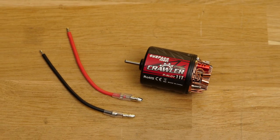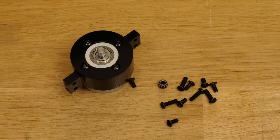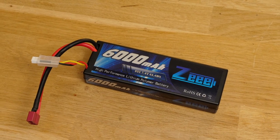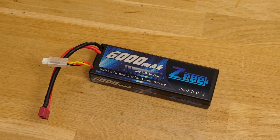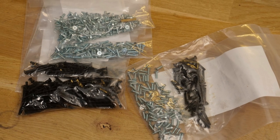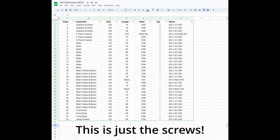In terms of part selection and sourcing, I'm building the Pro Drive version, which is what I'd recommend and was recommended to me by Sam Prentice. This exchanges the Pololu motors and PCB for some high performance motors with a gearbox and ESCs, or electronic speed controllers. I've also opted for a different battery — a 6000mAh 2S LiPo — which should work well for this setup. The BOM I worked off was quite limited, especially when it comes to electronics, wiring and screws, so I had to buy a bunch of different lengths and sizes. But this shouldn't be an issue for you if you use my BOM, as I recorded all the lengths and sizes that I used as I progressed through the build and created a complete BOM with all those details in it.